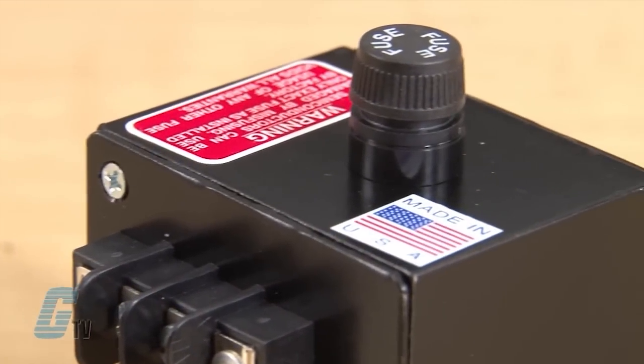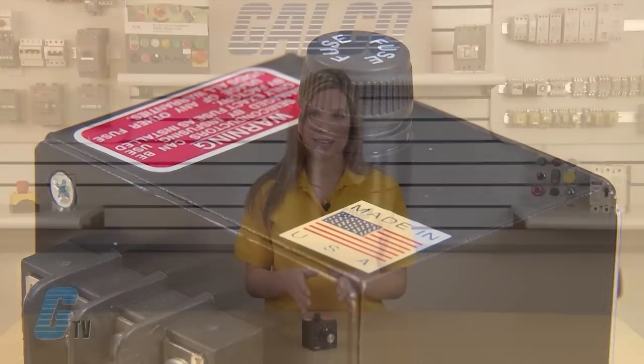The design provides protection for the power semiconductor components against damage. A 2-millisecond fuse allows protection against short circuit damage, and an RC snubber network protects against instantaneous rate of voltage change failure.